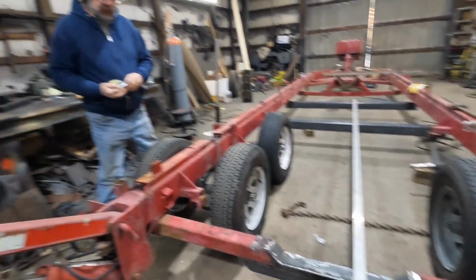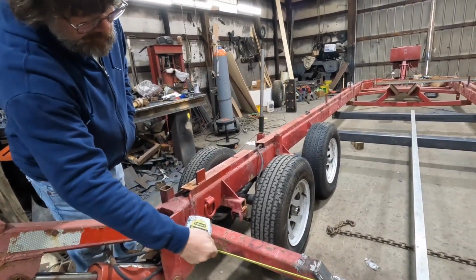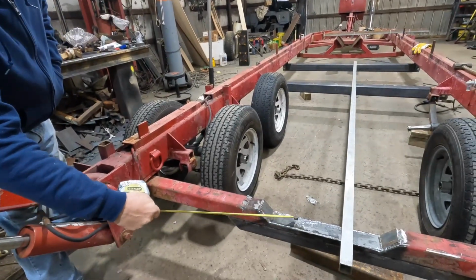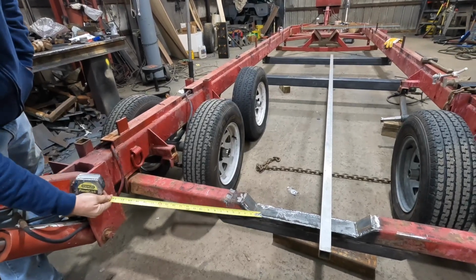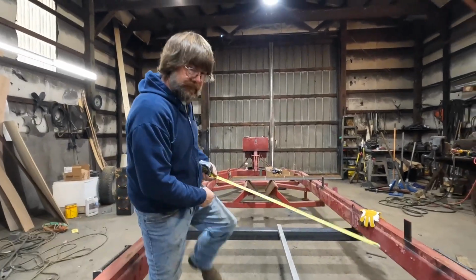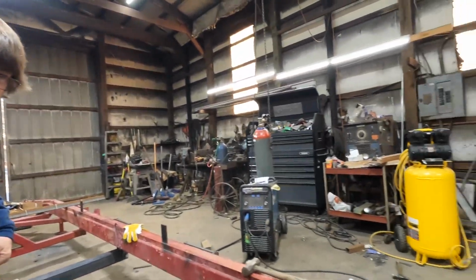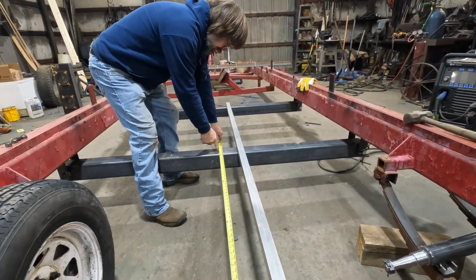And this is actually, that's got a piece of that 3/8 underneath this, so that's not hollow to crush. That's solid right here. Basically, we're going to cut that 8-inch channel. Right. And I'd let it overhang that probably 5-6 inches, and it's going to meet roughly in the center.